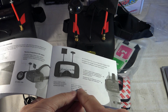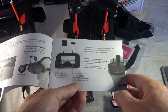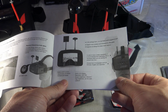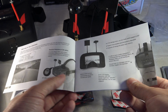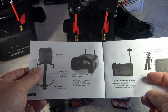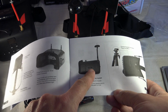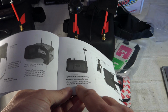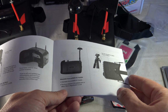But for PAL we have to push up to 576, so it will need to interpolate, and you will lose a little bit of precision for PAL display. The brightness is still the same, 500 cd per square meter, so nothing changed from the former LCD display. You can still change the position of the Fresnel lens to adapt to your myopia, and the internal Fresnel lens offers a magnification of 3.5.